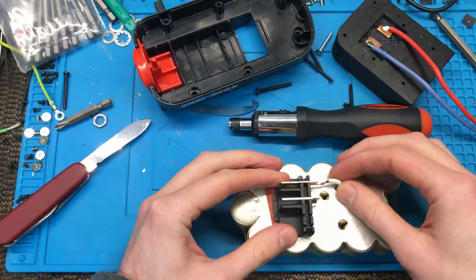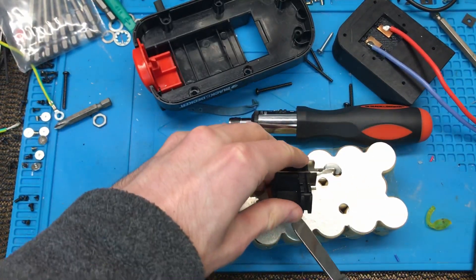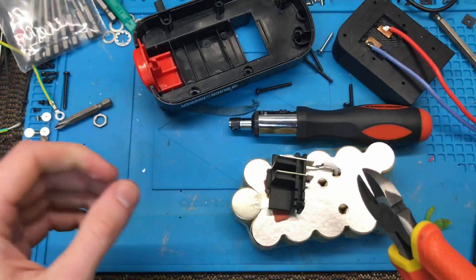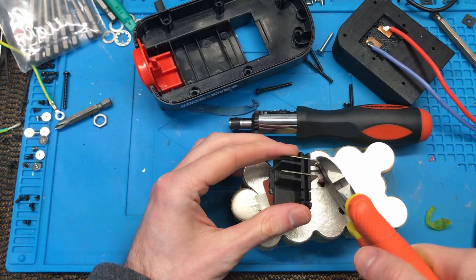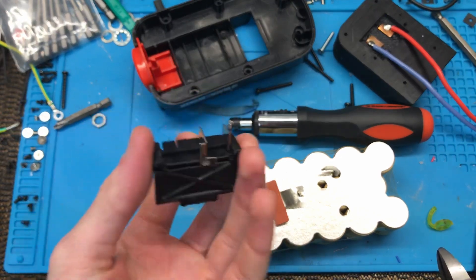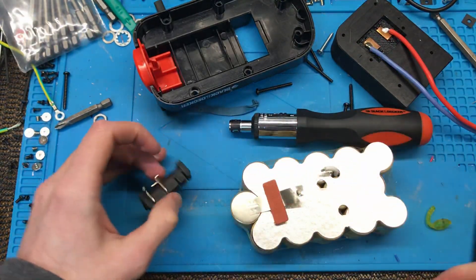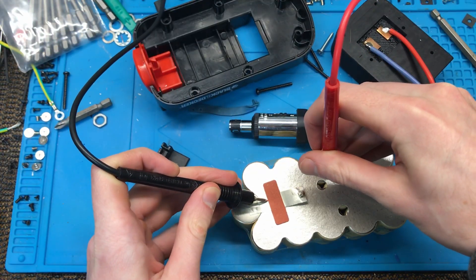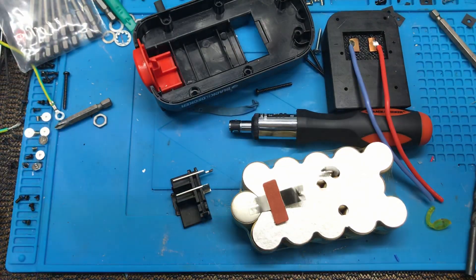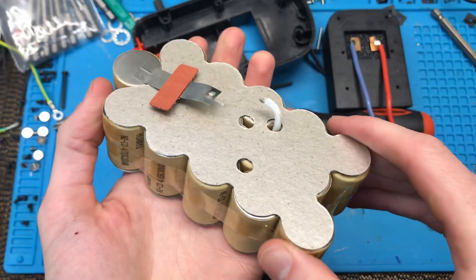Spring. So how are we attached on the bottom? Spot weld - just pop that off. And we'll just use a wire snipper here. When I say wire snipper, I just mean these - I don't mean an actual tool. It's worth more than $2. Now what I should have checked is the polarity here, because I don't see it labeled. But you can just check right here - which way is positive? So that means this is plus, and this is plus. So now we know who goes where. And this can just go in the battery recycling bin.